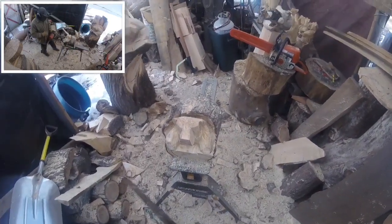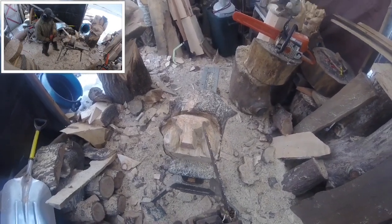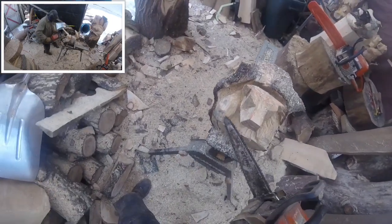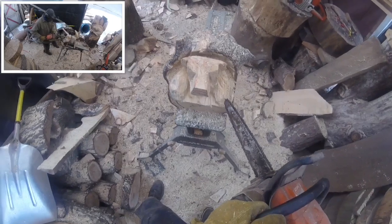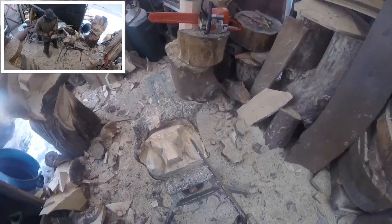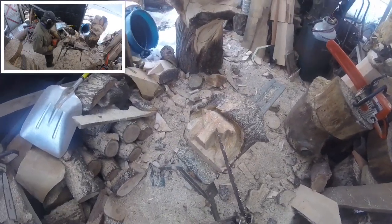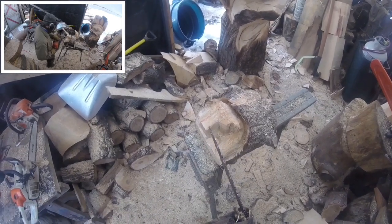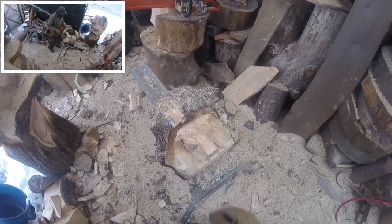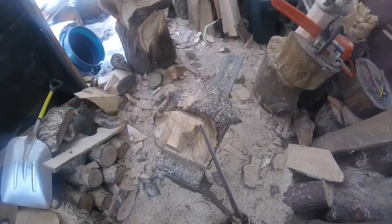So right now I'm going to use the dime tip bar kind of like a sander. It's sort of to clean up and round these edges, clean that cut out in the ear there, and use it at an angle for his claws. Okay, it's at an angle, kind of like when we've done the fur in other videos. And when you round the head, you're going to round right around like this and round right into the nose. Then come to the other side and do the same thing and try to duplicate the same shape. All right, and then we'll come in at an angle and go here and here.